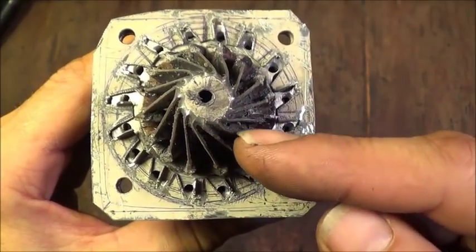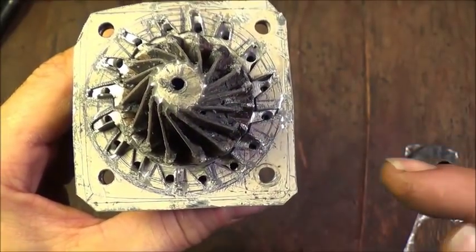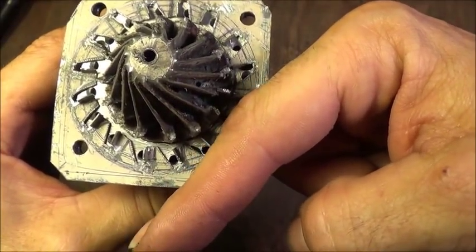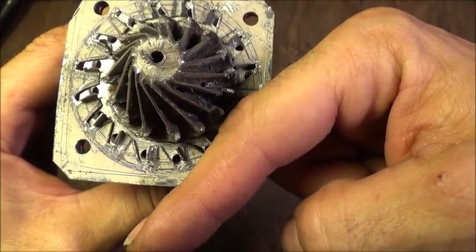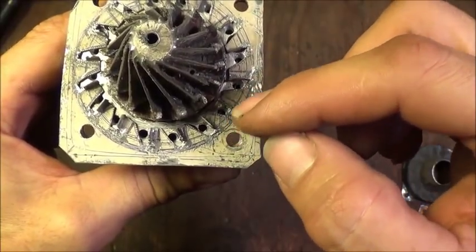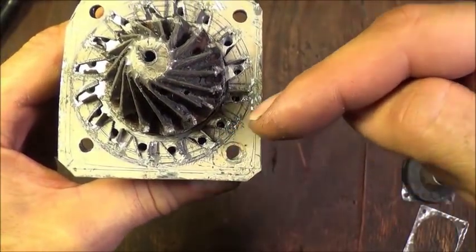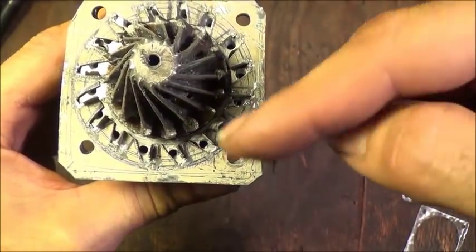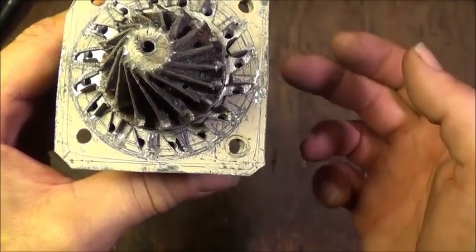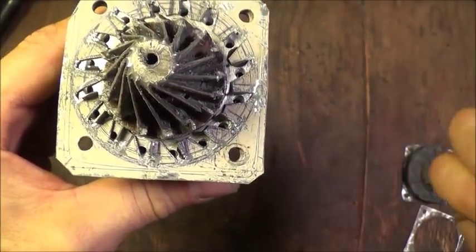If you notice the angles of the blades of the compressor, they're going to be blowing that air out at about this angle here. The first set of blades on the diffuser are bent back at this angle, so it's going to redirectionalize the air coming off the compressor back in the opposite direction. The little holes you see down here are also angled at a backwards angle compared to the airflow coming off the compressor — redirectionalizing the air again, creating another shock wave, slowing it down even more, and creating a pressure trap to make sure the pressure from the case can't come back out and that the velocity of the air going into the case is at a subsonic velocity.